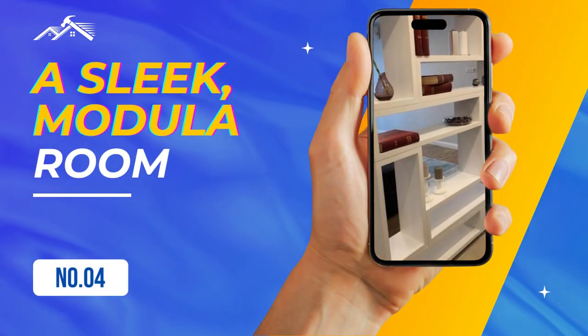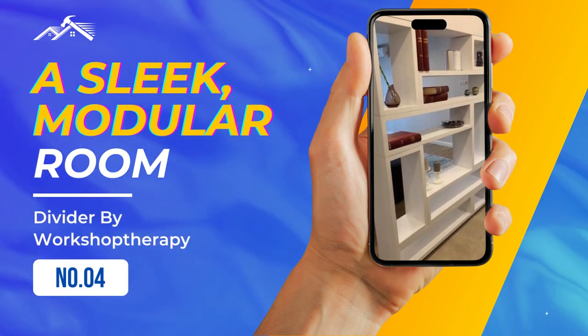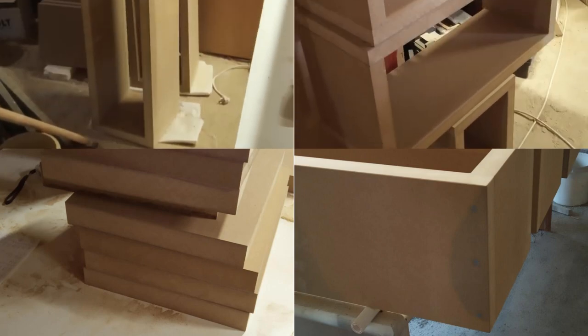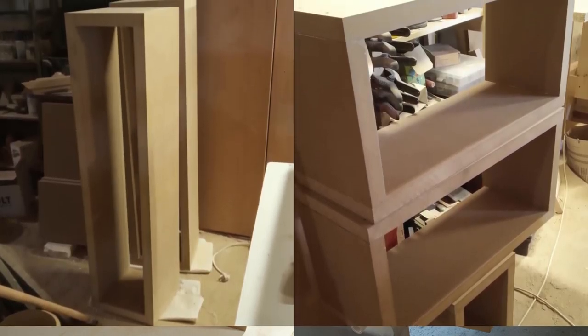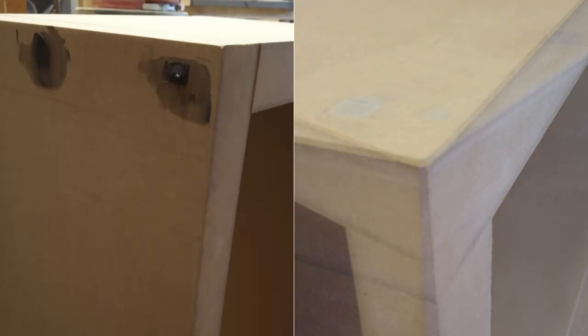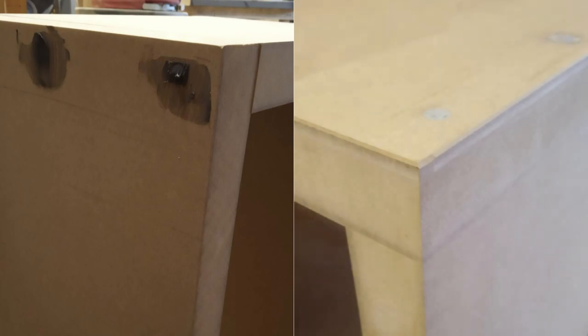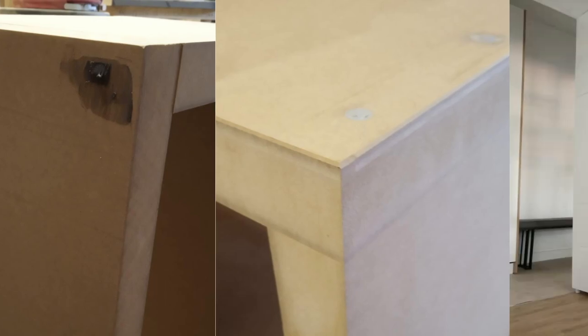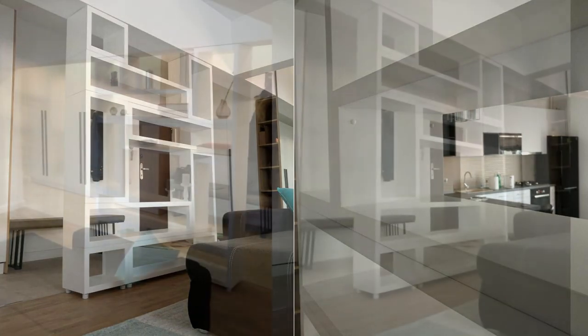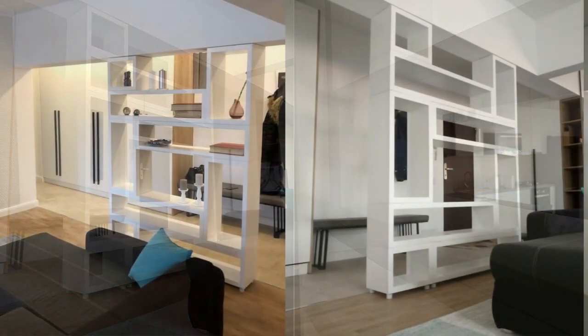Number 4: A sleek modular room divider by Workshop Therapy. Decide on shelf dimensions and opt for 40mm MDF boards, pre-cut — for example, 2800x2070x40mm. When assembling, use screws and glue. Pre-drill to prevent cracks. Mask screw holes with polyurethane mastic and sand. Prime, then paint — consider RAL 9002 with 2–3 coats, sanding between each. Finish with 3D-printed adjustable legs for floor alignment.